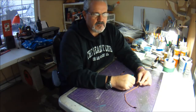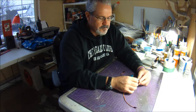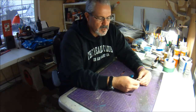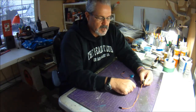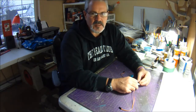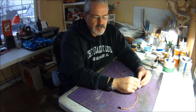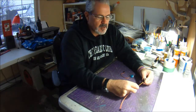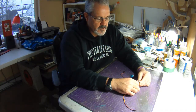Now, I was still trying to develop good light building techniques. And so then eventually I switched to six 9-gram nylon gear servos all the way around. And that lightened it up quite a bit, and I built lots and lots of planes with that setup, even with the 2200 kV 2212 motor, and I had lots of fun, good thrust to weight ratio, and that worked out just fine.